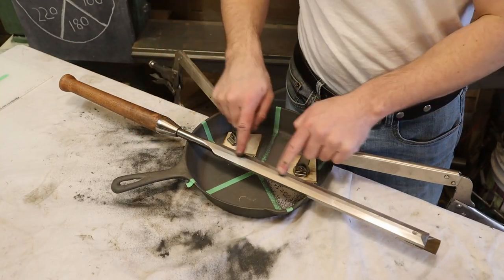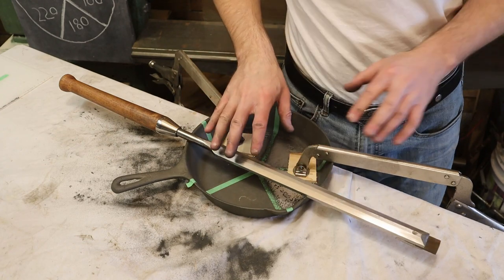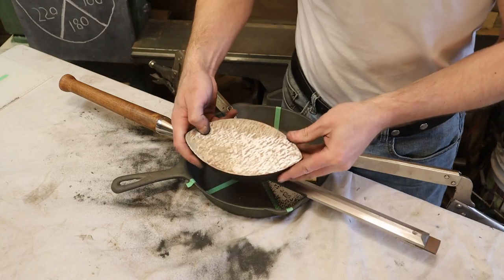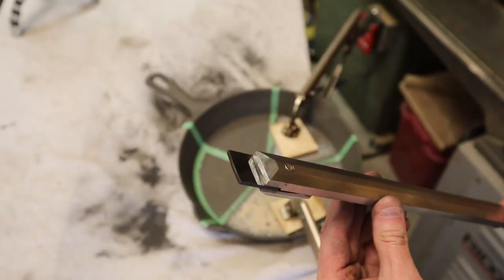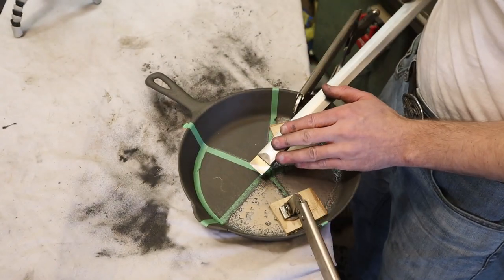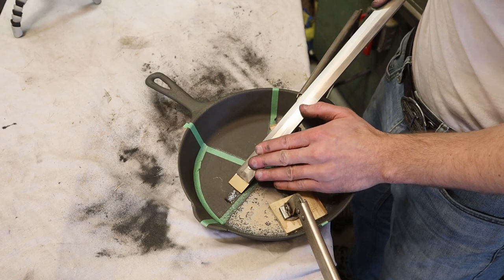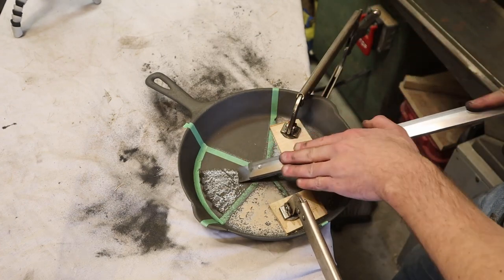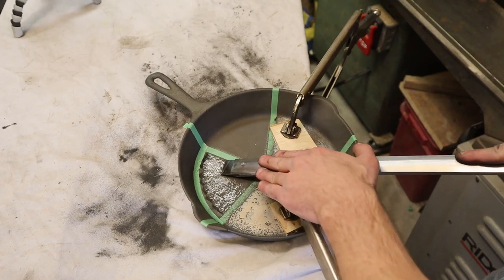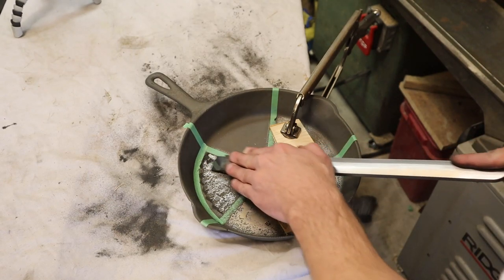In a previous video, I built this hand scraper. That's for machinery. If you're not familiar with that, here's an example of the kind of finish that you can obtain with it. Now, the purpose of this hand scraper is to flatten two surfaces completely that mate to each other. It lowers the friction between the two surfaces so they only touch on certain points, and it allows a place for oil to sit to provide constant lubrication on those parts as well, so that prevents wear.